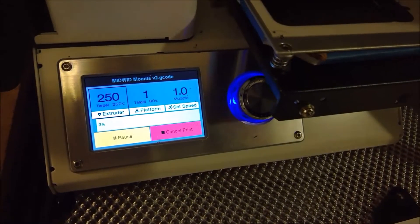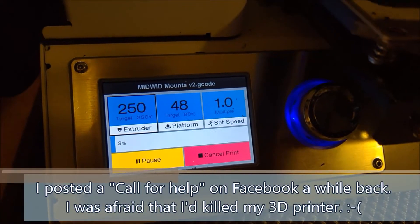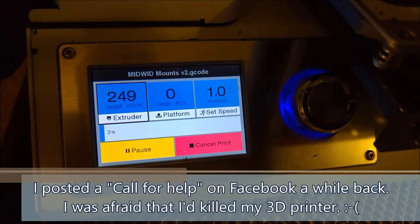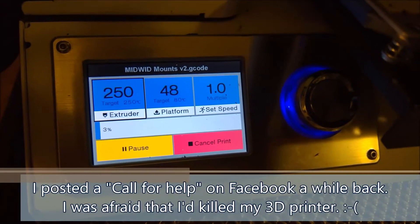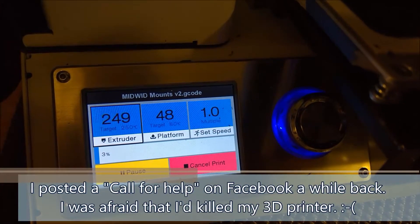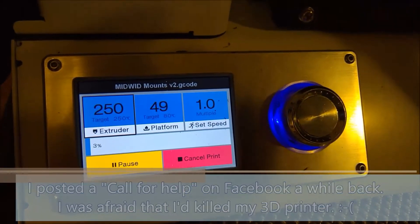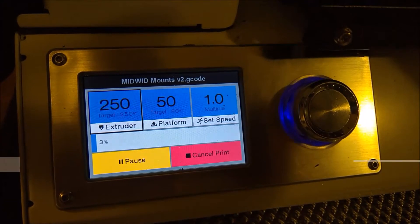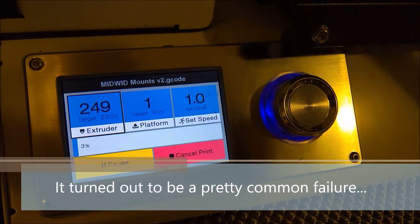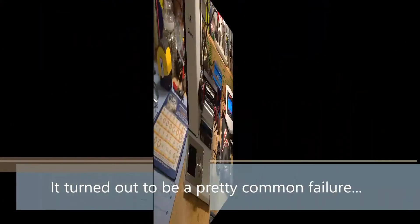I might need a little bit of help here. If you notice, I have my temperature set and the printer has started doing this where it looks like it's losing the temperature sensor data, basically going out of temperature control. If you print with an unheated bed for some materials, this could mean big problems. Has anybody else seen their mini do this, and if so, do you have any guidance?